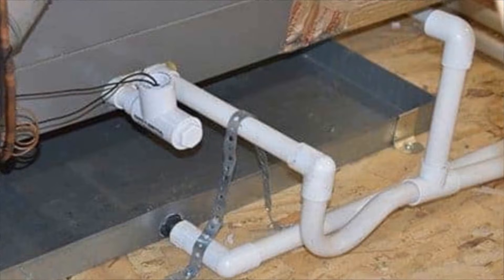Here's another look at that same scenario: you have a condensate switch — the inline switch — but used in a secondary drain. This way it's out of the primary drain and doesn't block anything. It's sitting in the secondary to prevent overflow into the pan below. The pan below has a secondary drain coming off of it that runs outside. When you run a secondary drain outside, typically it'll go out into a soffit, and sometimes it'll run all the way to the ground.